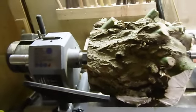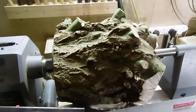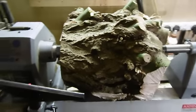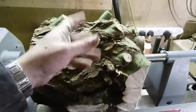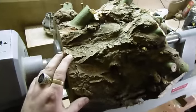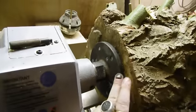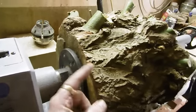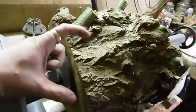Right, this is a piece that I'm going to be rough turning. It's wet — not majorly wet. I think it's been cut for a few months. So as it's turning it's not splattering me, but you can feel it on the chippings that it's still wet. It's probably about 30% moisture somewhere around there. Make sure you use a big faceplate, the biggest faceplate that you can use. This is technically end grain.